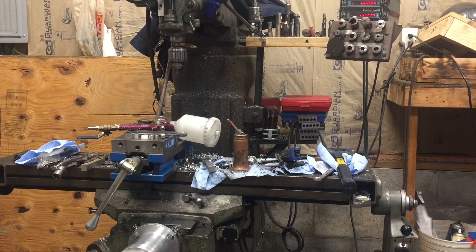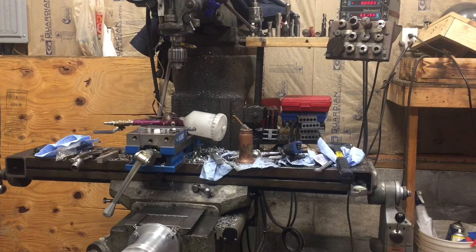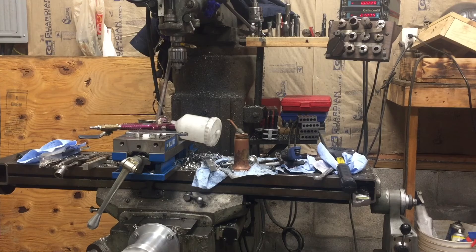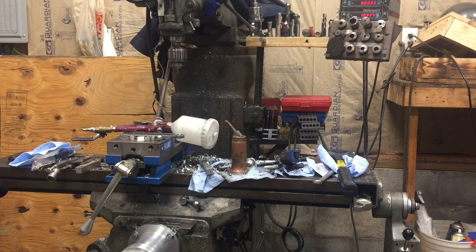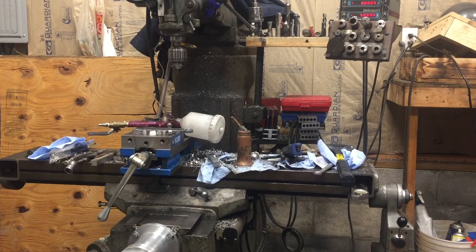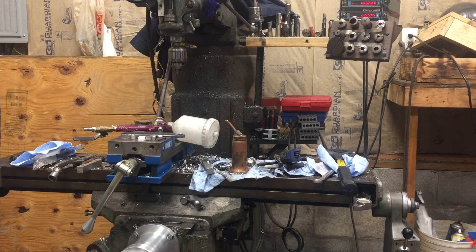Back to 500 RPM. Here's 550 — I've had it fault a couple times there, it'll jog a little but won't run for very long. We're about to exceed its limits. We'll try 575 — still able to jog with no following error. Going up to 595; I have had it fault at 600. There's 595 RPM with a 10,000 RPM per second ramp rate. I did not purchase the ClearPath servo power supply — just because I had one laying around. I've gotten a few voltage saturation problems with this high ramp speed, so I may go back to that after the machine is up and running.